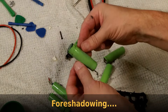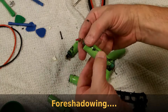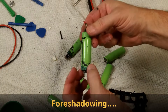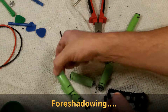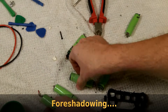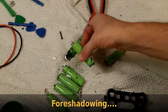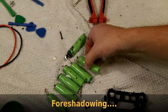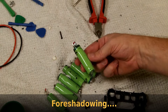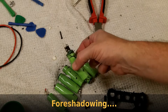It becomes obvious that these cells have bulged. You can see they're supposed to be the size of the holder, but where the holder isn't compressing them they've bulged out. It looks like several of these cells have gone bad - not just one. They've all started to bulge out. So it looks like the BMS was flashing red probably because these cells were definitely going bad.